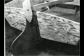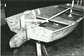You can buy complete white polytarp sail kits from PolySail International. Their URL is http://www.polysail.com. If you use a tarp, you can reinforce the bolt rope stitching with duct tape. If you feel you can't qualify as a sailmaker, turn this job over to a tent and awning firm. Lash the sail to the mast and boom with 3/16 diameter cotton rope.